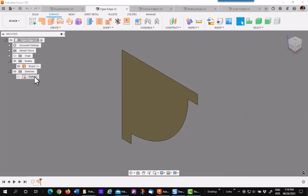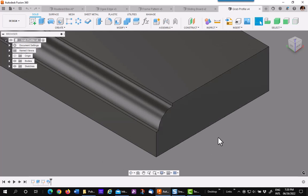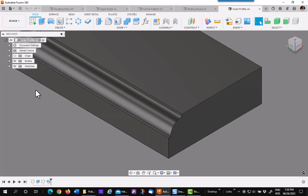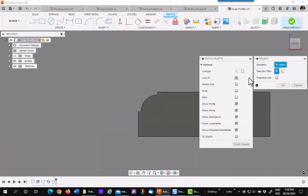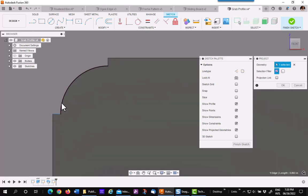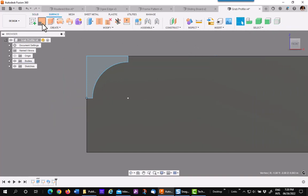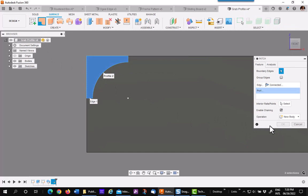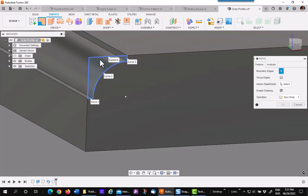Creating these surface patches is simply a sketch and then adding a surface patch. But you can also grab it from other models. For example, let's say I want to make a surface patch to match this and use it around the bottom of another model. I'll first make a sketch on this face and then go to project geometry. I'm not going to do a projection link, I'm just going to project some edges and complete the profile with a sketch line. I'll then go to surface and make a surface patch.